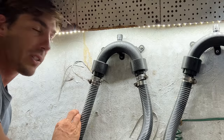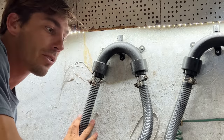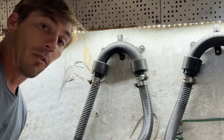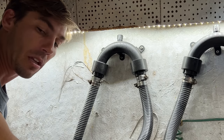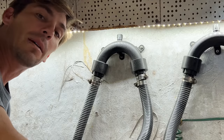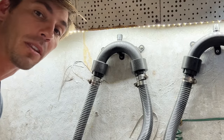So I got our whole bilge system worked out. As you guys can see, I started adding some lights down here, so we actually have some real lights. So one thing I forgot to say before, why I do not want any check valves in the main bilge system is because these are the main, primary big bilge pumps. If we need them to work, we can't have any opportunity for anything to be clogged up in those lines.